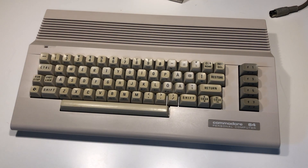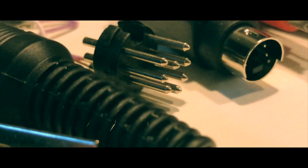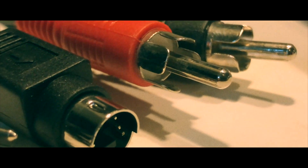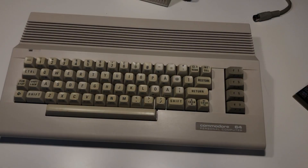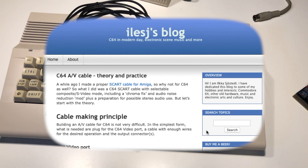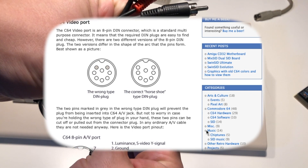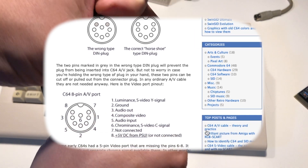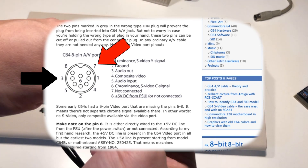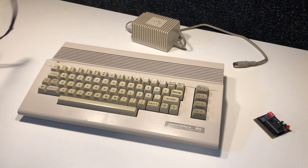Let's continue with the video cable. Here's the cable — I used the instructions from this blog. I will avoid pronouncing the name but it has great information in it. For example, there are two different eight-pin plugs and they look different, so you need the horseshoe type. I have also decided to put the second audio channel on pin 7, because this is the recommended pin to use in many of the stereo modifications.